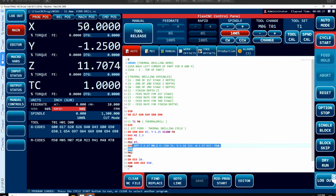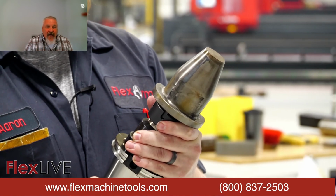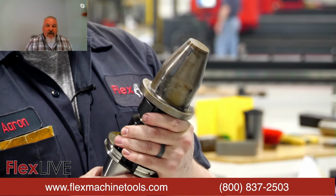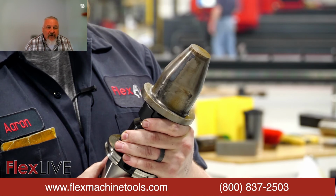Mitch, do you want to go ahead and explain a little bit on why we do that? Yeah, we have different stages because we rely on that bit to develop heat correctly to allow that bit to advance. So basically our RPM will remain the same throughout the entire program, as you see, but we want different Z depth settings with corresponding feed rates. As that bit starts out, we're relatively slow on the feed rate. We develop some heat in that material, it kind of softens and relaxes, allowing the bit to advance a little further. So we're going to speed the feed rate up as it allows us to. The goal is to get in and out as quickly as we can based on size and material, of course. We want that 3-step cycle to allow us to advance. So it's a slow beginning, and then we gradually speed up as we travel through the material.